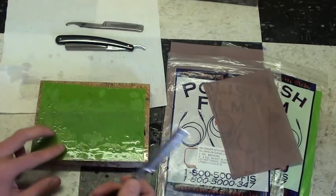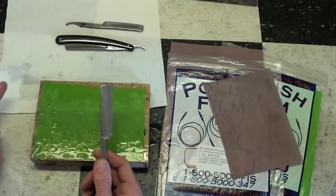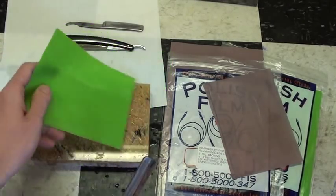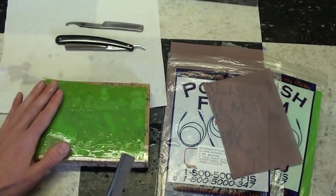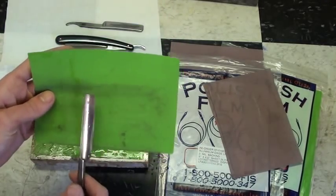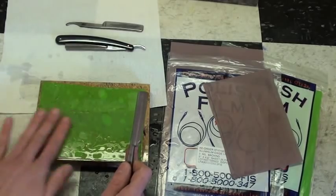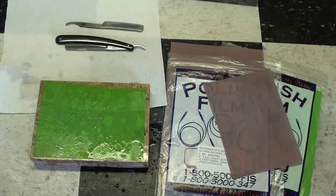You can switch to the other grades as you feel appropriate. The nice thing about this method is your sharpening stone always stays flat. These are cheap and disposable essentially — they'll last about three sharpenings before you need to get rid of them. This one is done; you can see all the metal particles embedded on it. And it's low maintenance.